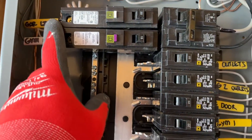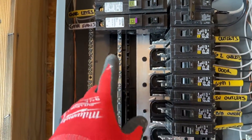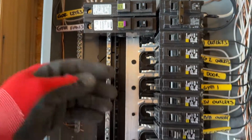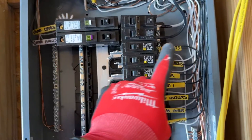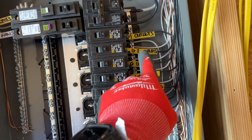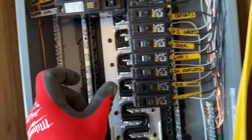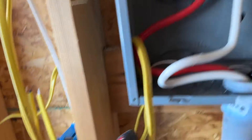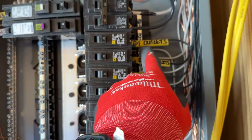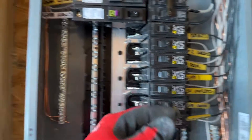To finish it off, I like to cut a little piece of the wire here and label them. So if I ever pull the panel off, I can see which circuit these go to. And then also when I'm labeling the panel at the end and I want to mark what each circuit is, I have it all written out here. I'll do different codes like G2, G1 — I try to make it short. Another thing is I'll actually mark inside the boxes, so if I'm ever working on this, I know that this G1 goes over here to G1. So another way to just tidy up your work and keep everything nice and neat.